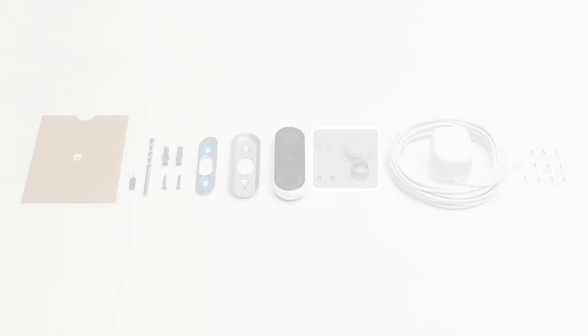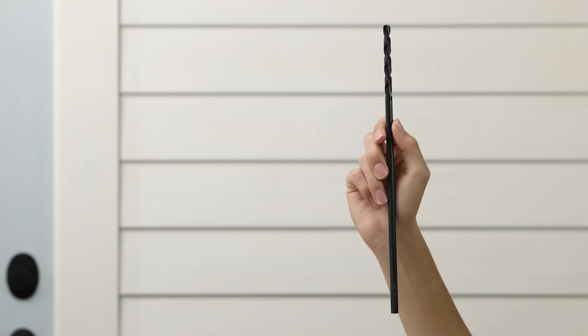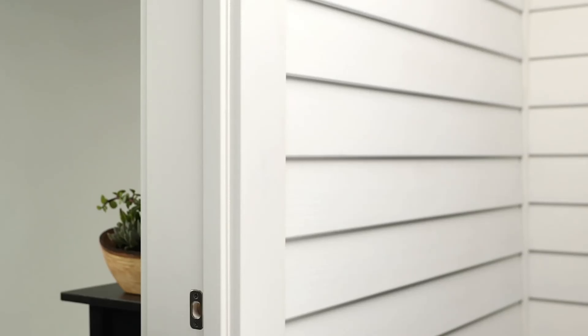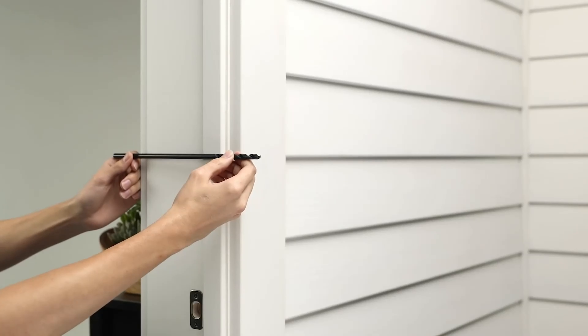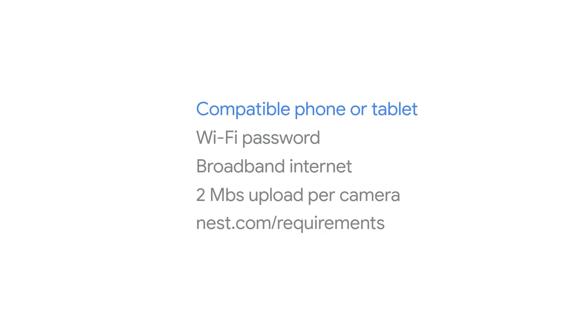You only get the one color — black — with a blue Hello light around the button. It may not suit everyone's taste, but it looks smart when mounted. However, the Hello is slightly more problematic out of the box, as it needs to be hardwired to your home's electrics. This means most purchasers will need an electrician to install the Nest Hello, and you'll also need to purchase a chime separately if your house doesn't already have one, adding to the cost. Installation time varies, but it took one electrician around an hour to fit the Hello, as they needed to run a wire from the nearest socket to the door.